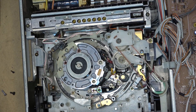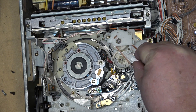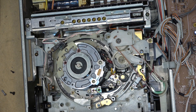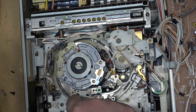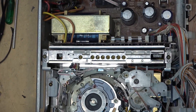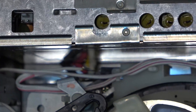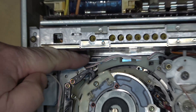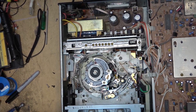A little different - you saw the other one had a metal lever, this one's got a plastic arm. It looks similar but it's actually completely different. Note that this one does not have a switch down here to detect when the mechanism is in the unloaded position. It still does have a switch at the back to detect when the mechanism is in the loaded position. These ones will experience a completely different symptom if the mechanism is in the loaded position with no tape in it.